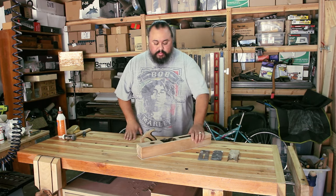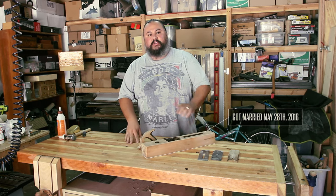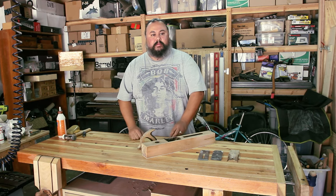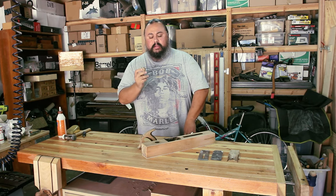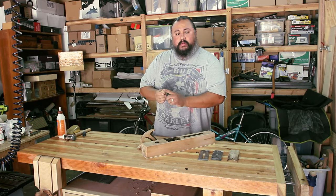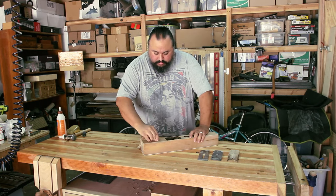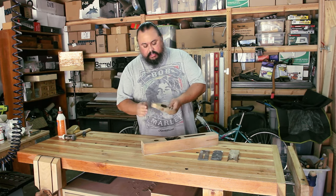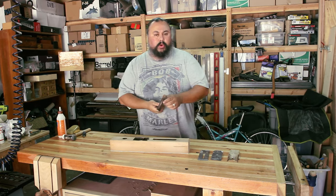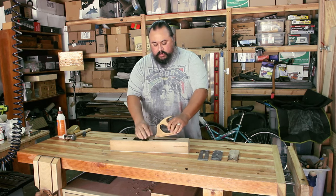While I was working on the plane, I noticed that the strike button was getting really dry and damaged, and you saw in the little video that it just basically broke apart. So I made a new button. I went over to the lathe, got this nice piece of white oak, and made it into a button shape, which I will be putting in here. I cleaned up the handle to a point. It's not perfectly clean, but it's clean to where I want it, once I oil everything.